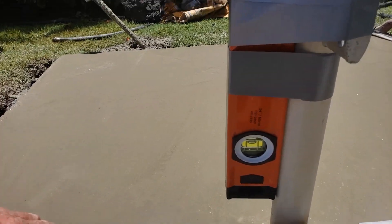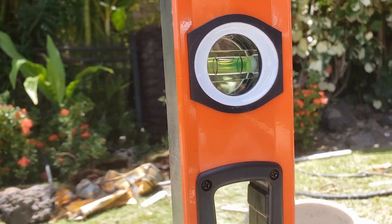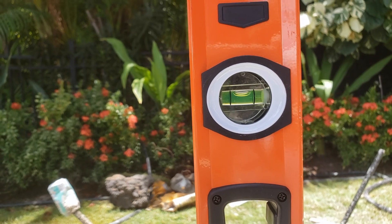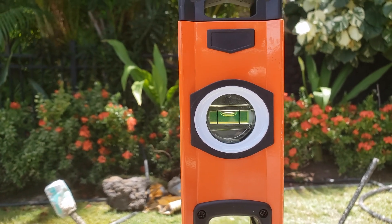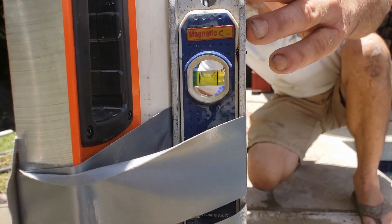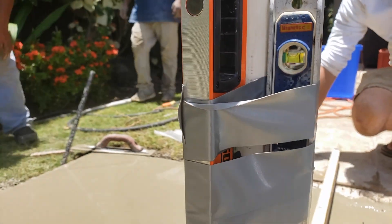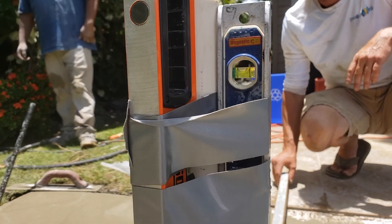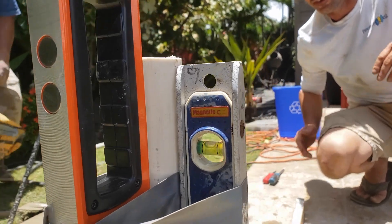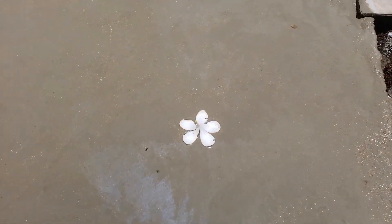Once our level is down to make sure we're at the exact right height coming up out of the concrete, we've got our neutral bubble there and our neutral bubble there. There's a little bit of slop inside of the shaft for the chair, so it'll be all right, but you want to be as perfect as can be. Take the level and slide it over just slightly — nice, right there. We're going to let it sit and keep checking it every couple of minutes. We've got to keep up with our quality control.